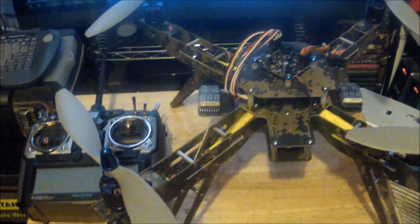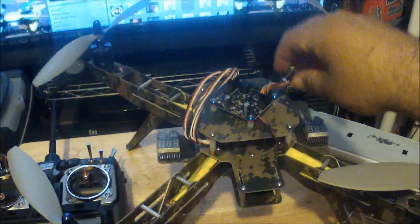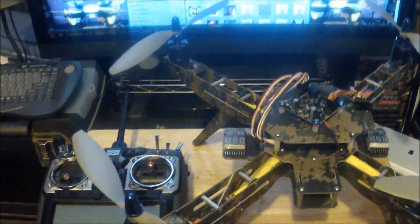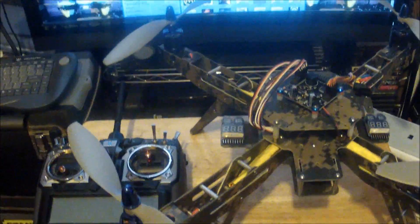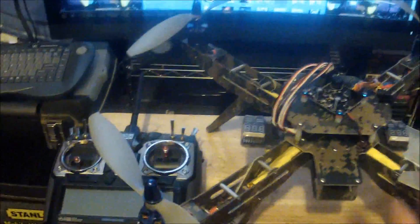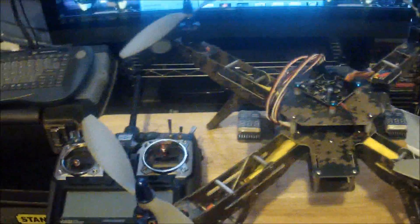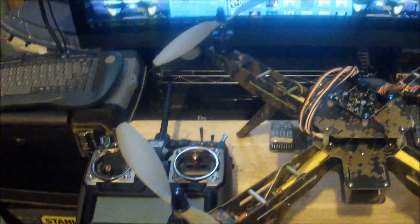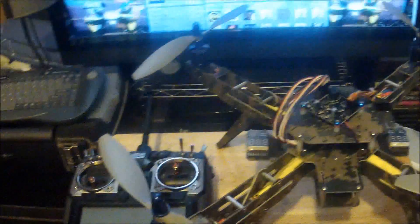One of the things you have to do is read the instructions and make sure you plug the ESCs with the props spinning in the right direction and have the receiver plugged into the board in the right order. The reason I'm making this video is because the instructions for this particular board are poorly translated into English, so they don't explain the calibration process clearly. After struggling for a while, I managed to get it done right.